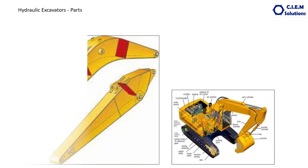The next component is the stick. This is the stick. It is a box section metallic steel structure made with steel plates, with internal supports and in some cases with reinforcement. Welded hinges hold the cylinder ends. This is to connect the bucket and the boom, and this linkage gives forward and reverse movement to the complete bucket. Simultaneously, it also slightly helps in the digging action of the bucket.